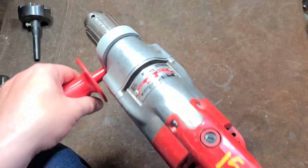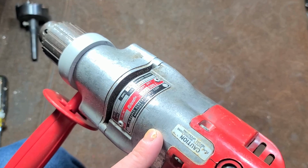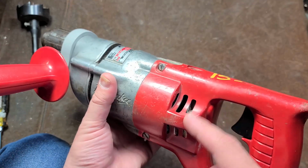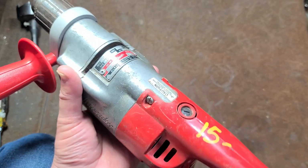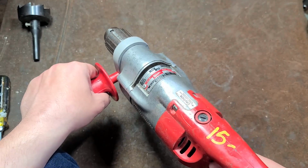The big deal about this is just the fact that even though it has what would be arguably a pretty weak motor, only 4.5 amps, you just have a lot of heat sinking ability, a really big commutator and large oversized brushes, so they can really deliver the energy with lower resistance, and they can just take a lot more heat and a lot more continuous kind of abusive operation.